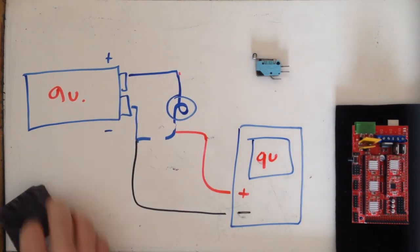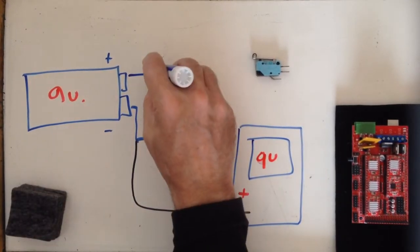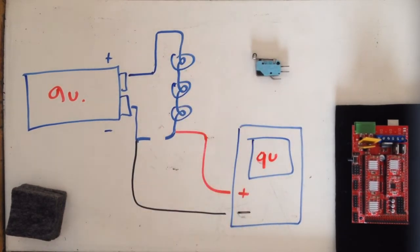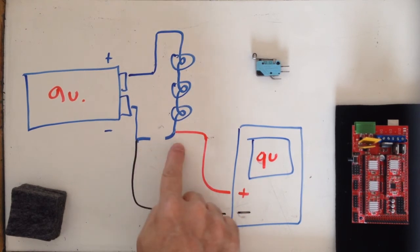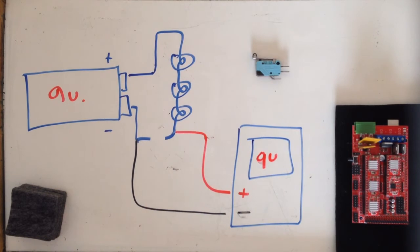And by way of example, I could draw this circuit with a whole bunch of different loads here. I'm going to have 3 light bulbs, and let's assume that they're all the same values, voltages, and resistance. I'm still going to read my full 9 volts there. I don't have current flow. I don't have any voltage drop across these loads.